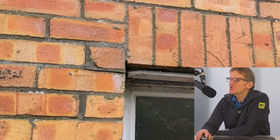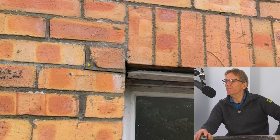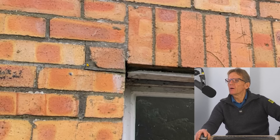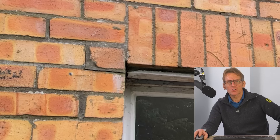What he's wondering is, if you look at where this lintel is, he wants to put a galvanized steel lintel in there. The internal one is fine - it's a concrete one - so this is a cavity wall with two separate lintels. He just wants to replace the outside one. Whether he's doing this job himself or not, I'd recommend a bricklayer. Steve and Alex do loads of lintel replacements - watch their YouTube channel to see how they go about this sort of job.